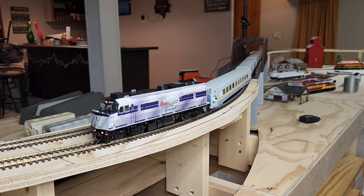And via practice, when two F40PH-2D locomotives are operating in a consist, both providing HEP, both should be operated in run. This applies whether the locomotives are running elephant style or back to back, and it applies when both locomotives are at one end of the train or top and tailing the train, so one on each end.